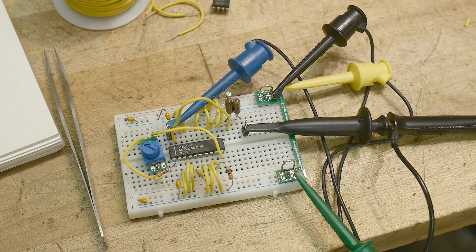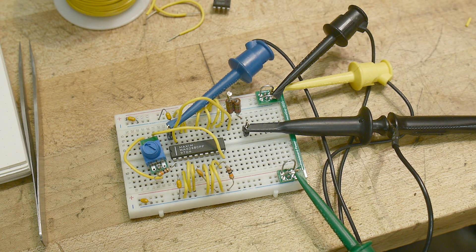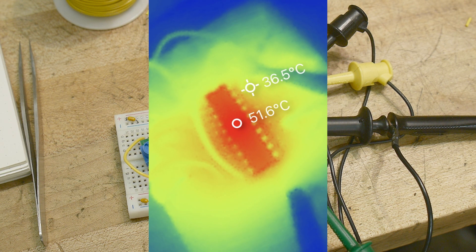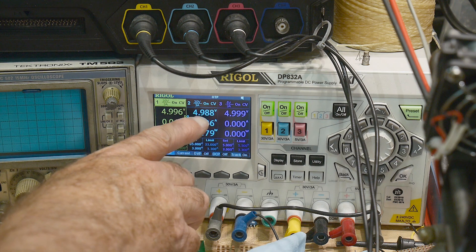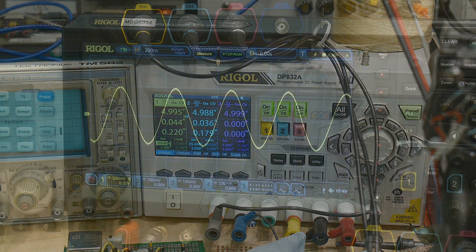Like I said, it's plus or minus five volts. I used my IR camera to look at the heating — it does get a little bit warm. The general rule of thumb: if you can leave your finger on it without going 'ow,' it's about 50°C — that's your calibration. The minus rail is drawing 44 milliamps and the positive is drawing 36 milliamps. Even with a maximum load, it doesn't change much — most of the power is consumed by the chip itself.